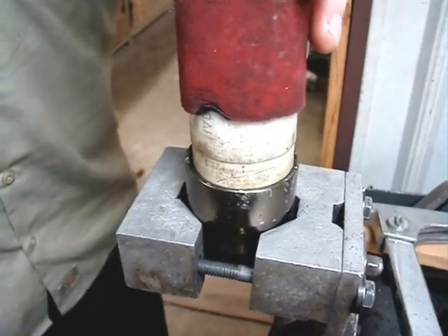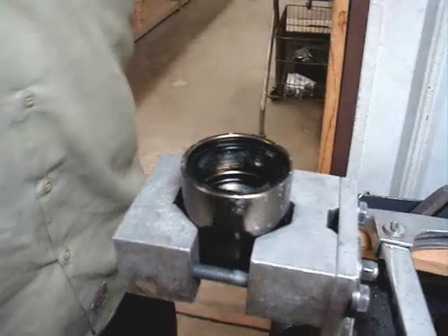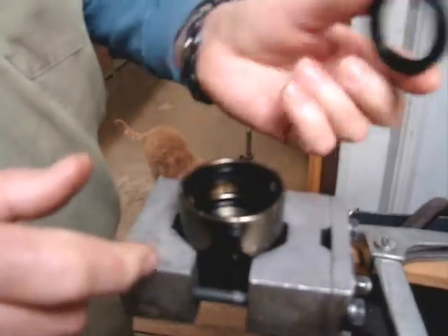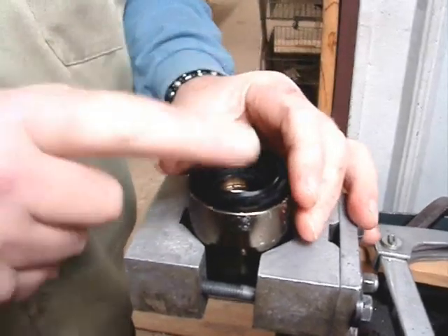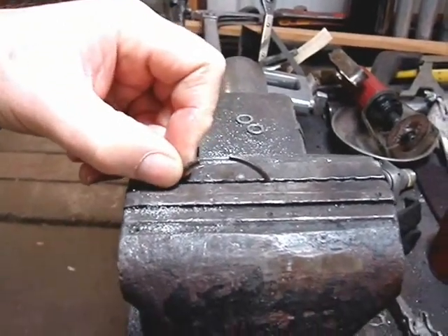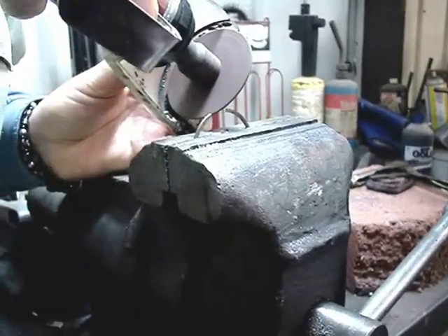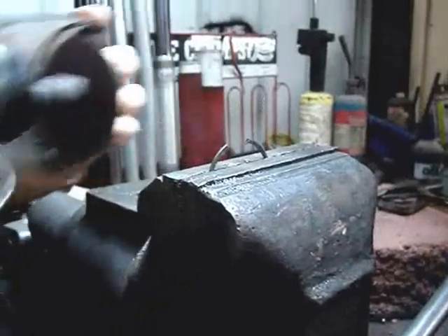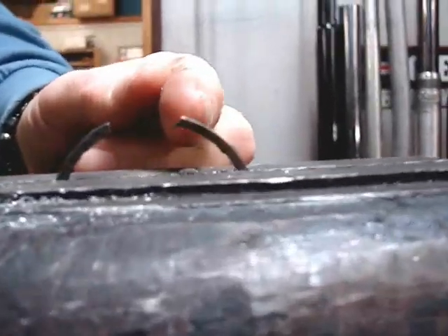I made this seal driver out of PVC pipe years ago — I had to take a little bit off on the lathe. Alternatively, you can take your old seal and lay it on top of your new seal and use it as an installation tool to press the new one down in there. You should put a little bit of grease on the outer edge of the seal. Then I modify these circlips before I reinstall them — I cut about a 45-degree bevel into one end of the circlip, so that lets me, or whoever works on it next time, get under the thing with a tool.